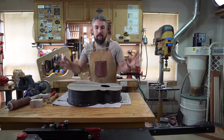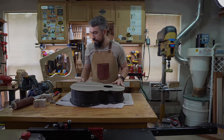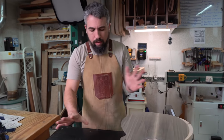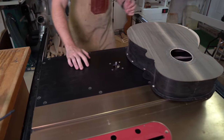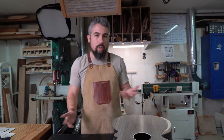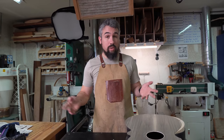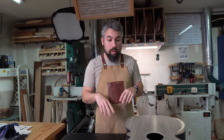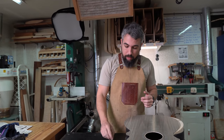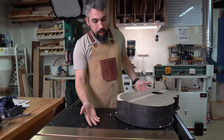We're going to get moved over there, rearranging the shop. My crappy little makeshift router table here — it's like a rigid laminate router that I have temporarily set up, and it works pretty decently. It does the job. This is one of the very few things that I use a router table for. It's pretty self-explanatory: we have a flush cut router bit with the bearing on the side of it, so it's going to ride along the sides and give us a nice cut.